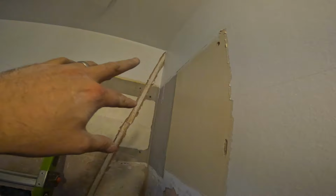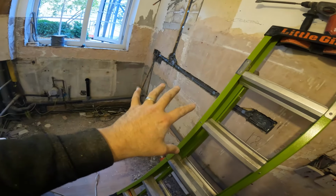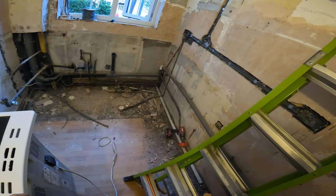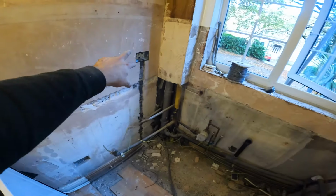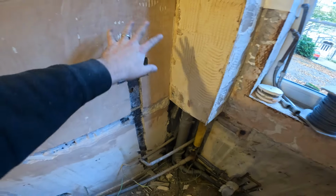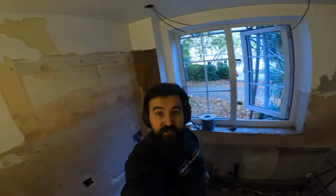Right, so we're just going to get that cable and extend it down through one of these zones to where the isolation point is going to go for the hob. And that is about it. So we'll have that, and then obviously we've got this section still to wire. We explained how we did that, extending that ring. And I think that's about it. So we'll get those two cables in, and that'll be this kitchen done.